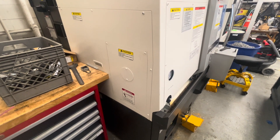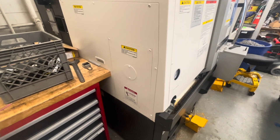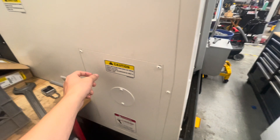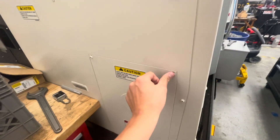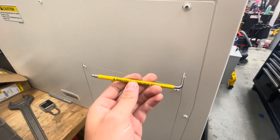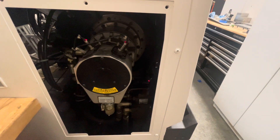We're going to fix that. Making our way to the back of the machine, we're going to look at the draw tube sensors, which are behind this panel right here, held on by two little allen key bolts. They need a four millimeter allen wrench, so I'm going to go ahead and take that off.